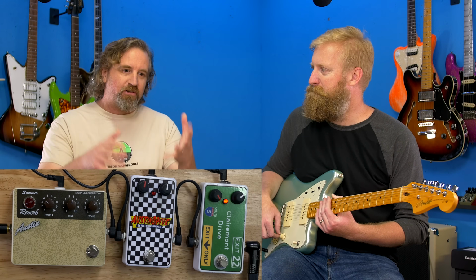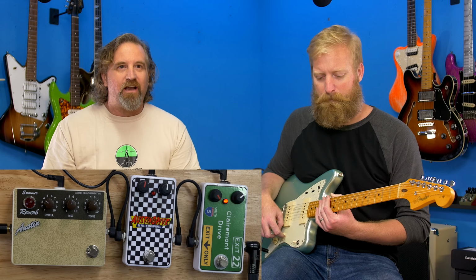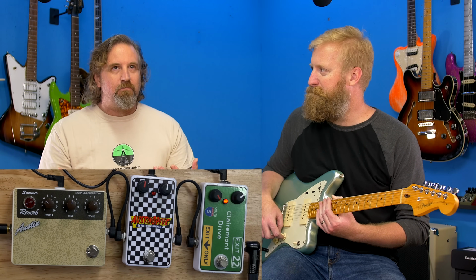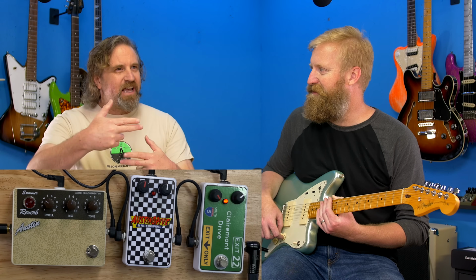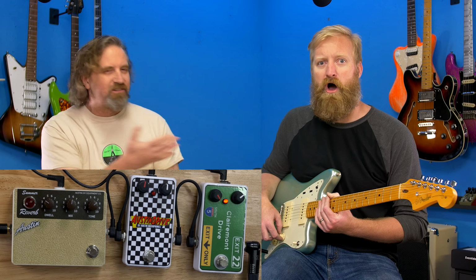So there's clipping, and then it goes into a preamp, and then it goes into clipping again. So you can dial in all that stuff and make it however you want. You could do what's it called, offset, where you use like 2 diodes in one direction and 1 diode in the other direction. Are you familiar with any of this? I'm not. No? Okay, so...